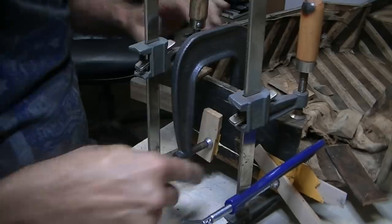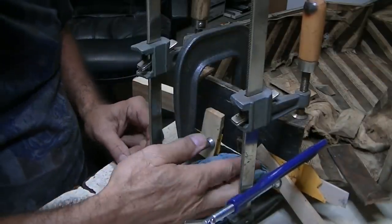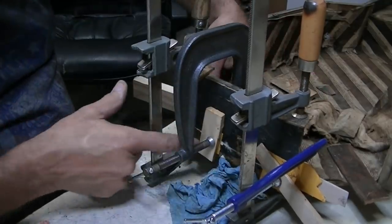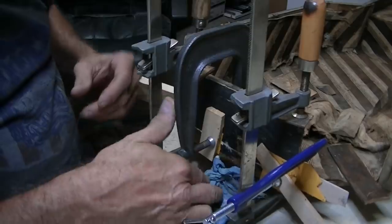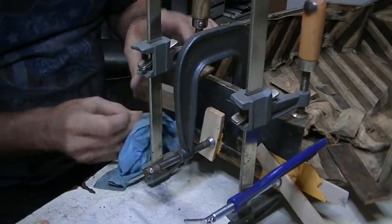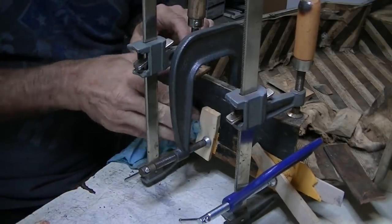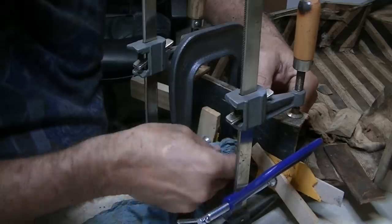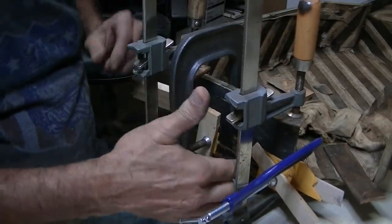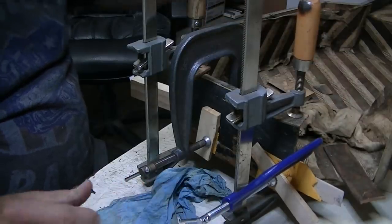You can see I'm making it cry now — all that glue has come pouring out of that crack. I knew there had to be a better clamp than what I was doing. I basically had to clamp it from front to back with these two clamps to keep it in line, because it's cracked at such an angle that it wanted to slide down the angle. I put plastic where the clamps touched so it hopefully won't stick to the glue. Now it's pretty straight across where that was a problem before — pretty well lined up. We'll give that a couple hours to set up and move on.